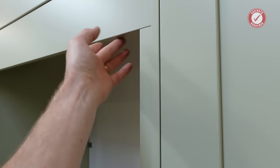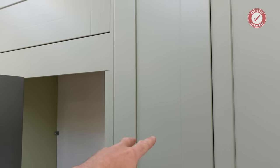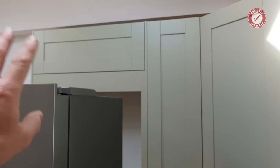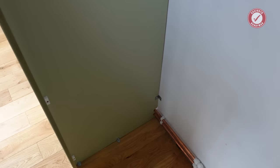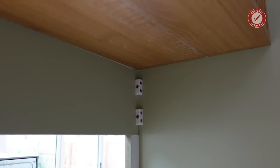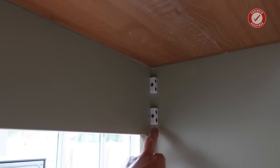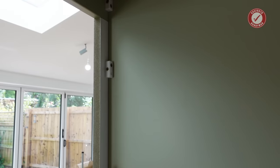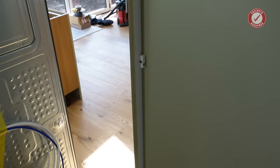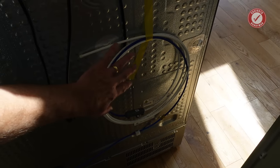I'll just show you how I fitted the trim around the edges, because this basically nicely boxes in the fridge. You should really have another big tall unit on the left hand side of a top box like this, but it can be done just with an end panel — that's the way we've done it because we didn't want it eating into this side of the room too much as we've got a radiator down here. So we've done it just with an end panel on the end and it nicely houses the fridge. In terms of the trims for the fridge housing, these are just held in with these little brackets — I call them Conti brackets but I can't remember the official name. They just hold in the little side strip all the way down that edge.